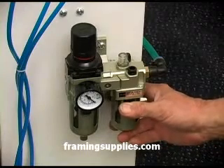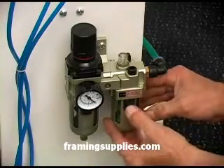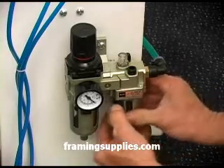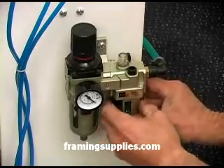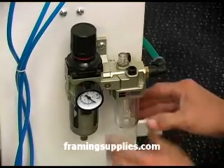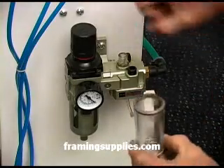We need to remove the oil before shipping the machine. We will show you how to fill the machine oil reservoir. First you pull down on the clip on the front of the outer oiler shell. You wiggle and pull down to remove the outer shell. Next you pull the glass container down while wiggling it, then fill it up with oil.